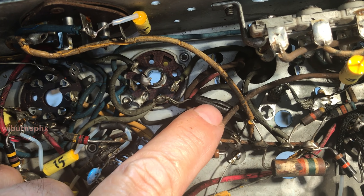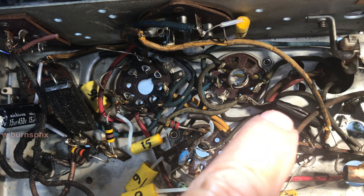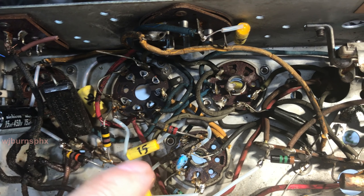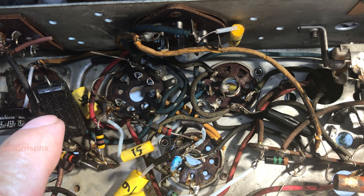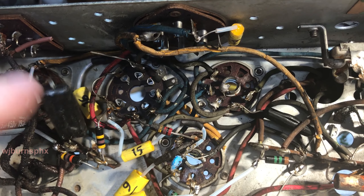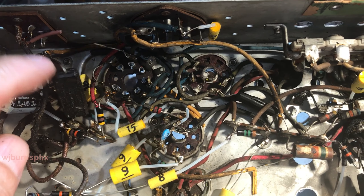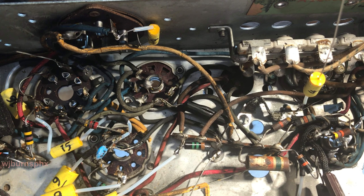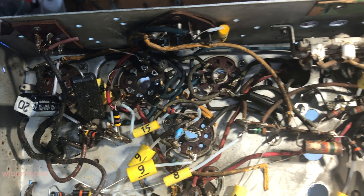These two are wire-wound resistors. This one here is nearly a two watt and that one is a half watt. I've got a two watt for that one and I think I've got a five watt for this one. I got a bunch of wire-wound resistors that I ordered in bulk, right around the values of these, because I wasn't sure if I was going to do any more Zeniths. I hadn't seen any in quite a long time on eBay, but I went ahead and bought them for the last radio and ordered them in multiples. It's a good thing I did because I've got two more of these waiting in the wings.